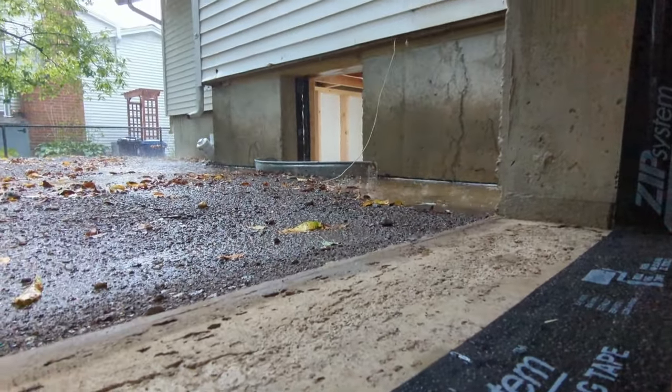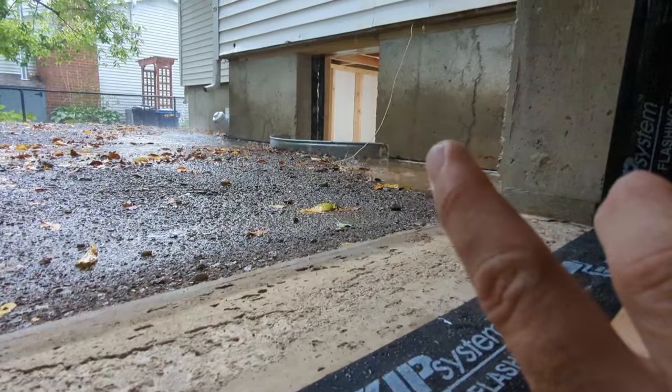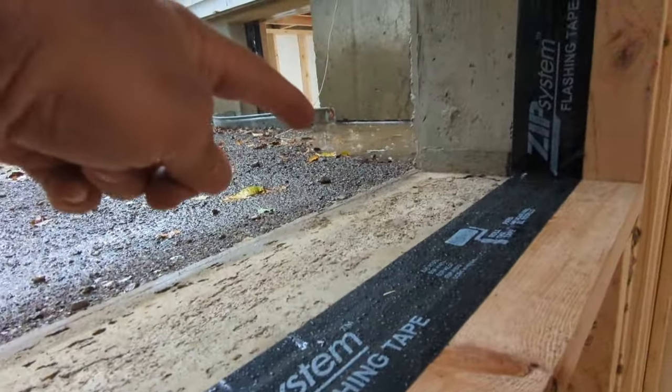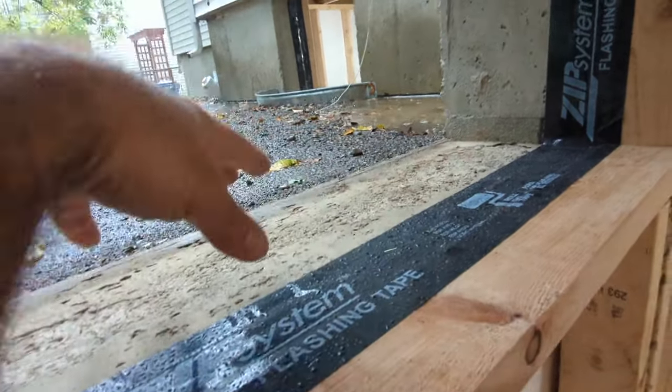But you see, this is the state of the gutters. Even though we're missing the downspout, areas like this, look at the side of the foundation, is soaking wet. Now the point of this, everything puddled here? It's going to migrate down through the ground, and it immediately can't get through that heavy plastic barrier that we put on. It's the black barrier. That can't get into this foundation. It can come all the way down, and it could maybe go across the top of the footer, but then it'll go off into that drain on the inside or the outside of the house and into the sump pump and get pumped back out. But this moisture here, into the mortar and all over the glass block, it'll be here eventually, is what you want to stop from happening.